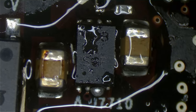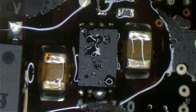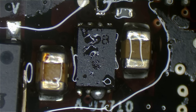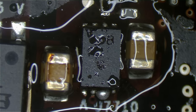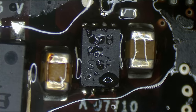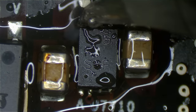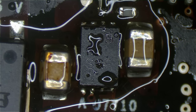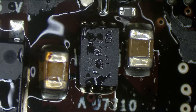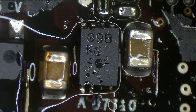And we're going to wait for this to beep. Beep. Beep. Beep. Very good. Good little HAKKO. Take minimal time touching up the joints, and blow away some excess flux. And while it's still hot, that is the time to clean it.